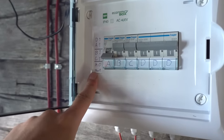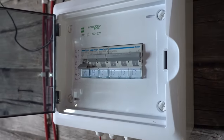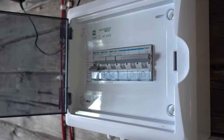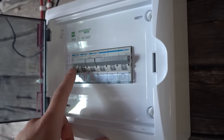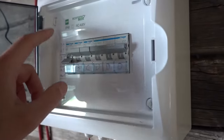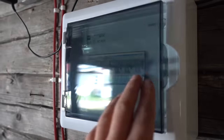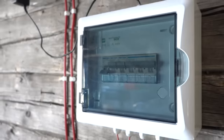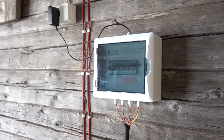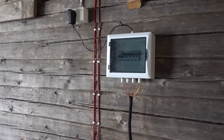I have the startup sequence here also printed. Basically you have to do kind of a dance: you have to turn on first the pre-charge, then negative, positive, and then turn off the pre-charge resistor so you don't burn it. The pre-charge resistor is just there to avoid any sparks coming when you connect the high voltage battery. All this is explained better on GitHub.